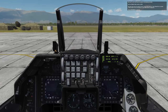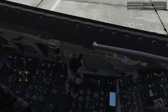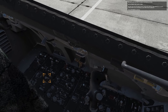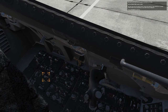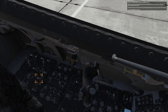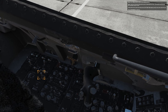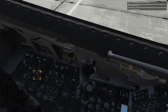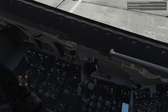Now we will verify that the trim system is functioning correctly. Set the trim autopilot disconnect switch to disconnect. Use the trim hat on your stick to trim at both pitch and roll — there should be no control surface motion and no movement on the trim wheels or indicators. Return the trim AP disconnect switch to the norm position. Again, use your trim hat on the stick to trim at both pitch and roll — the control surface and trim indicators should move. Center the trim for pitch and roll, and use the yaw trim knob to check the center trim for yaw.